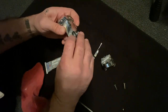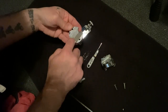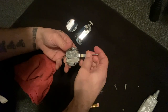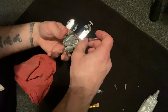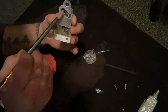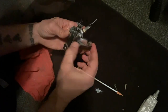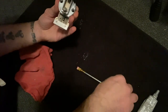The simplicity of the engineering of this piece is what makes it wonderful, and that's most evident upon reassembly. To reassemble, just line up the button and the base with the hole in the lever. Then this button on the lever fits into the cutout of the cam. Then simply install the cap and the two screws that hold all four pieces together.